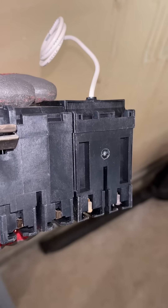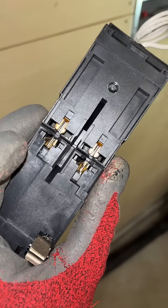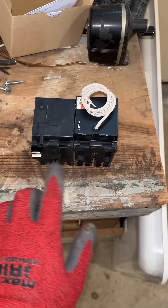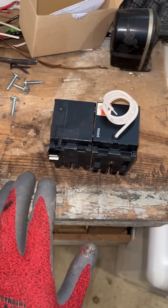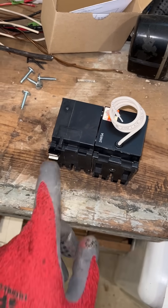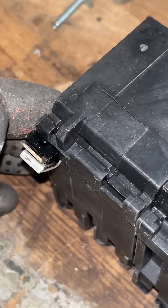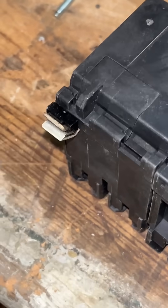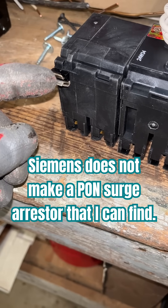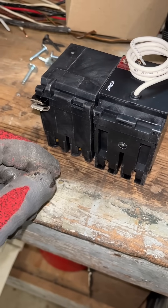The critical length is the same. The latch styles are the same. Contact spacing is the same. So all of the latching surfaces on the Siemens and the Eaton are basically the exact same size, but two things prevent this Eaton from working: this plastic tab right here, which I would say is specifically to prevent compatibility, and then the plug-on neutral contact here, which would need to be slightly moved in order to work in the Siemens panel.